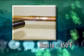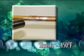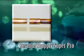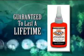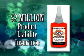If you need to take an HVAC Super Pro bond apart, heat the bond to approximately 450 degrees and it will pull apart. Resand and reapply HVAC Super Pro. HVAC Super Pro is guaranteed to last the life of any HVAC or refrigeration system and is backed by $2 million product liability insurance.